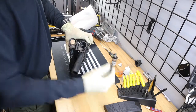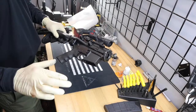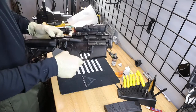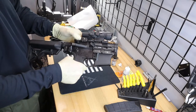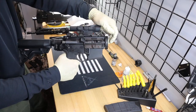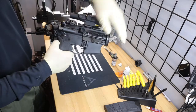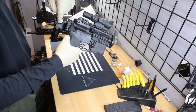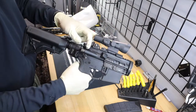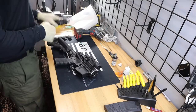Fold your Law Tac and put the plug back in. What you never want to do — pistol caliber or rifle caliber, doesn't matter — is when your barrel is not on, do not pull the charging handle back and let it go freely. You can pull it back and ease it forward, but when there's no barrel there's nothing pushing the bolt back that sixteenth of an inch, and it'll allow everything to over-travel forward. Your buffer will impact the buffer detents and your bolt carrier gas key will impact your charging handle, and those two parts will break.